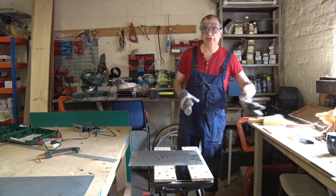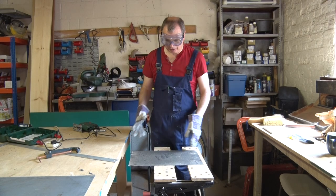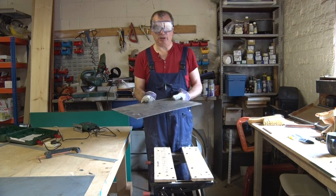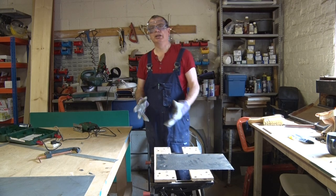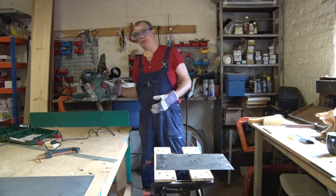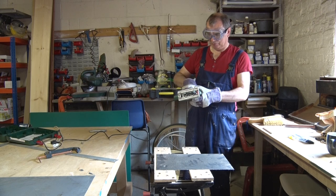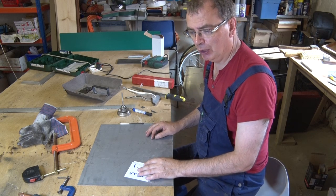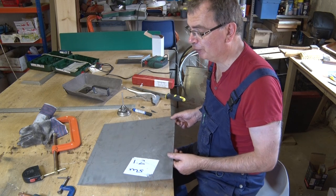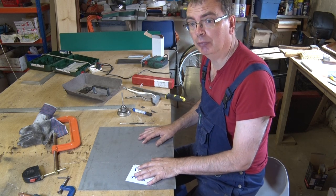The next stage is to cut the steel for the doors of the various ovens and fireboxes. For this I'm using sheet steel — this is standard 1.2mm thick mild steel. I'm not bothered with the galvanised Zintec stuff. You'll notice I've got gloves on and safety goggles on — it's very easy when you're working at home to forget to use these things, but it saves your fingers and your eyesight. I've now cut the steel for the front of the doors. For the proving oven and for the firebox they're just going to have a straightforward piece of 1.2mm mild steel cut to size.